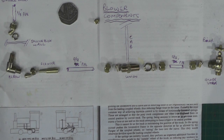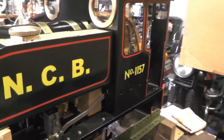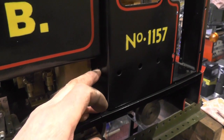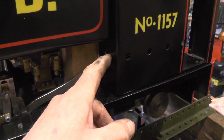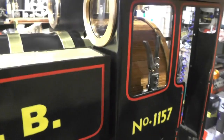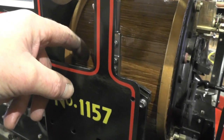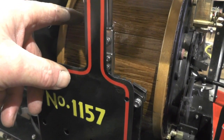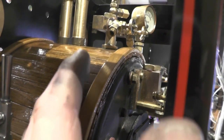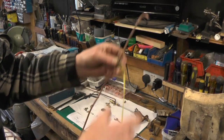I've just roughly put the tank on some blocks to determine where my blower pipe can come through. I've found the best place - in my case I'm going to come underneath the tank. I've drilled my hole there and I'm going to put my union on there. Now I've got to determine how much pipe I need. I'm going to come up the boiler in a straight vertical line, then horizontal across, then up around the boiler to pick the valve up. I've cut a piece of pipe 15 inches long.